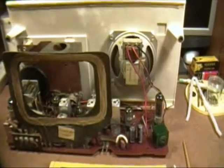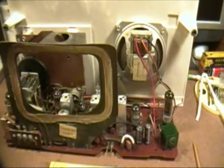We're at that point with this radio — we're ready to fire it up and measure the voltage off that selenium rectifier. The reason we do that is so we can get the exact same voltage with the silicon diode replacement, and we'll talk about that when we get to that point.